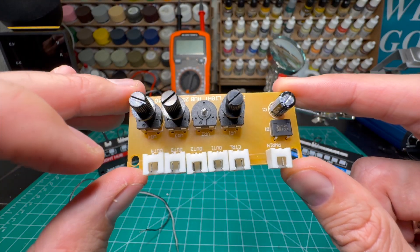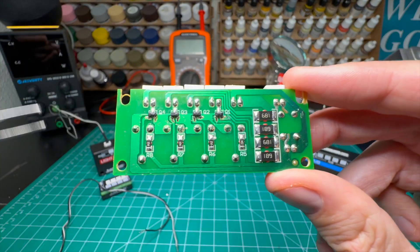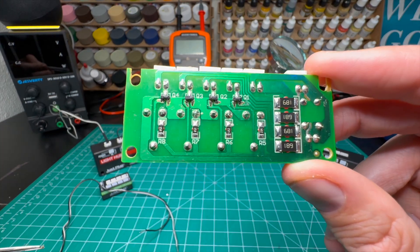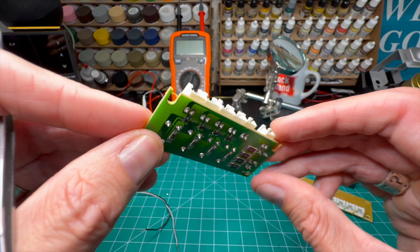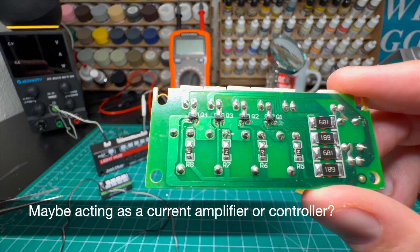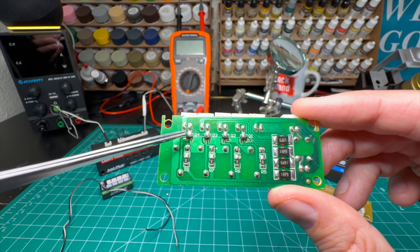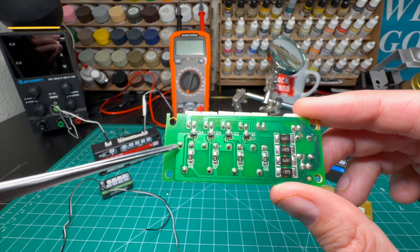If you are purchasing a JustPlug power supply, it is 24 volt. Coming back to the underside, from the negative pole you have a transistor, which is probably related to current control — that's pretty much the only reason you might have a transistor there. It doesn't seem directly linked to the potentiometers, but my guess is that it is related to current control. It's not the same as a constant current driver, but given that it's on the negative side, that makes sense because it's also ganged over to the potentiometer complex.